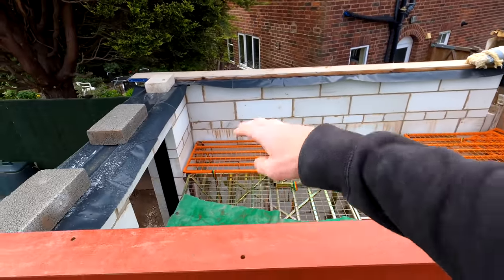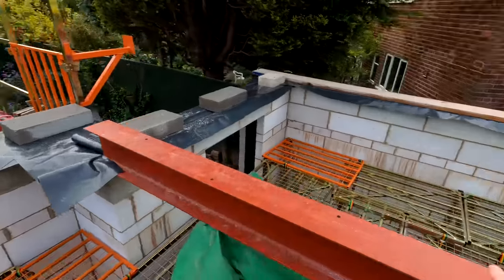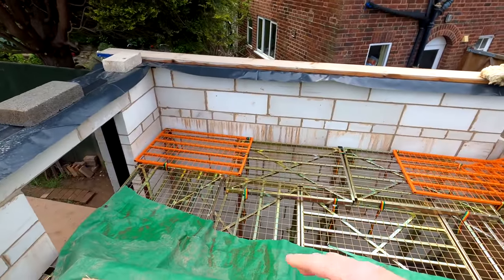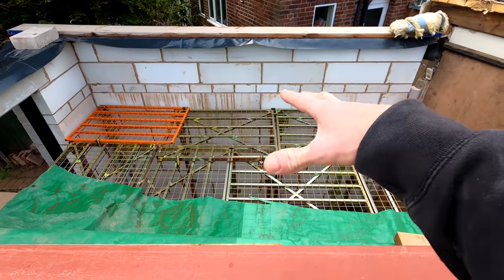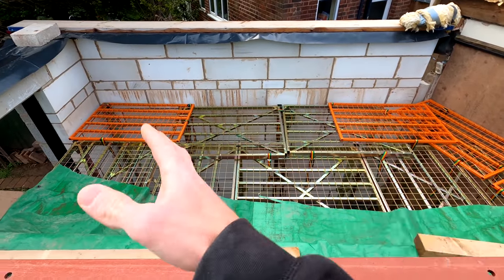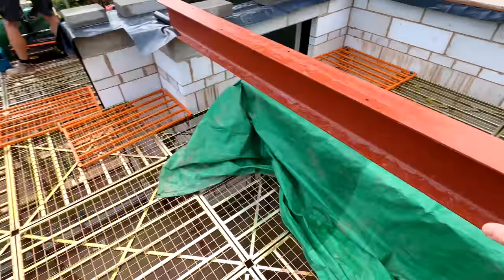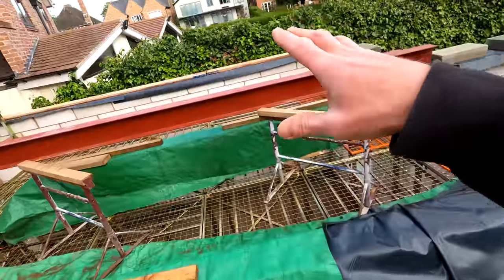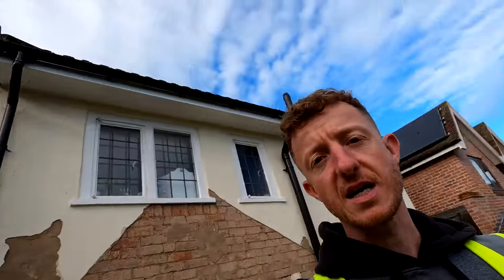So what we're going to do, we'll get some of our rafters in across here, and then we can basically use the collars over there to set up exactly where we need to be, because obviously we're going to need to put double trimmers in alongside it here, just to support it when it's in there, so we can get all this completely set out and ready now that they're here. So that's one job there, and then obviously we've got to replicate that over here with our two windows. But I'll show you the whole process as we're going along.